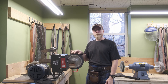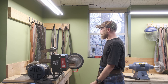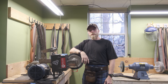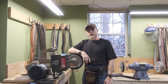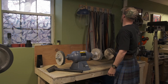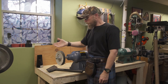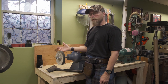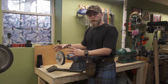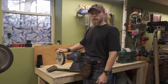Most of my shaping of all materials — titanium, handle material, metal, whatever — is done right here on the grinder. I put mine by the back door and window with an LED overhead. Makes for a whole different experience when trying to get those details and tiny scratches out prior to buffing. Over here, my main buffer — I also have a secondary light, a window for a light source, a secondary LED light, and a spotlight I can move around, which I can use independently for catching those little bitty tiny imperfections as you're buffing. Super important.